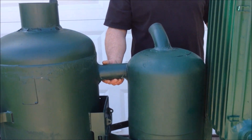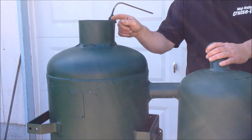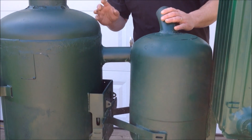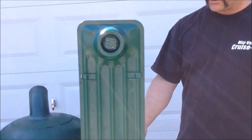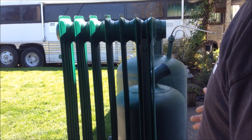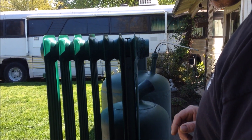From the reactor to the cyclone filter, these pipes are two-and-a-half-inch exhaust pipe. The burn tube is a quarter-inch pipe — we didn't want to worry about how hot it got; it can glow red for all we care. It goes from two-and-a-half-inch exhaust into the old oil heater — a heat exchanger — which does a pretty good job. By the time it gets to the filter, it's basically whatever temperature it is outside.